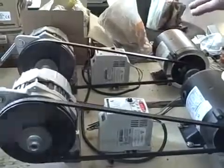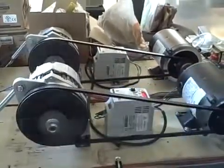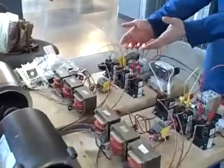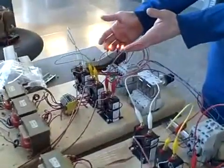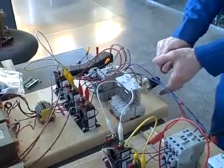It's slightly different frequencies, and for that reason slightly slower speed, and it looks like the tape is moving backwards. What we're going to do here is synchronize these generators together using our breaker and monitoring our sync lights. I'm going to wait until these lights are off, and when they're off and the tape is in the right place, I'm going to close the breaker.